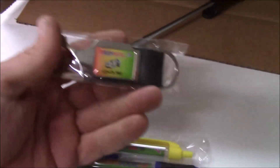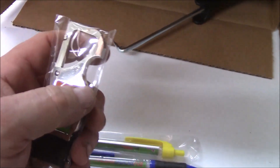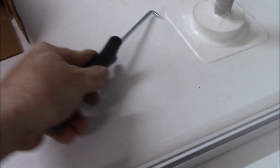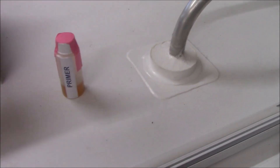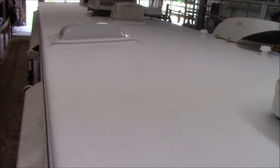In the care package we've also got a magnet for maybe the hood of your stove, a couple of pens, and a key tag with a beverage opener. There's a checker tool — you check the weld joints by sliding it along, and if it pops into a little hole you found a gap. If you do find something, take primer, a little brush, put it all in there, then add some caulking, and you're done. We can take a look at it when it comes back. I don't want a little tiny problem to turn into a big problem and an upset customer.